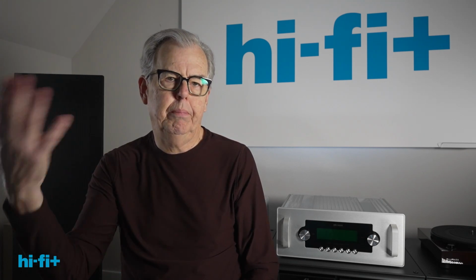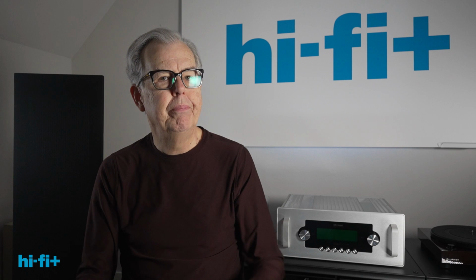So the interesting ideas in the Magnepan Ultra-wideband Bass System are, A, dipole, so that you cut down the number of axes. I should have said before, by the way, that subwoofers in general, regular subwoofers, one woofer in a cabinet, are omnidirectional. So by making it dipole, you have no output on the lateral dimension to the woofer. That reduces its interaction with the room, and then on top of that, you make it ultra-wideband, and by making it ultra-wideband, you end up being able to go well beyond the Schroeder frequency, and the subwoofer's own strange roll-off isn't upsetting the operation of the whole system. So that's the basic idea behind the UBS.